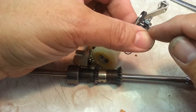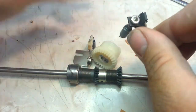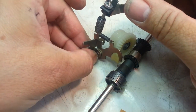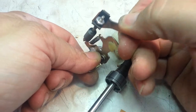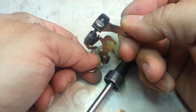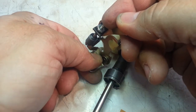Just tighten that up against this spring piece here and that's it — it's locked. Get it a little tighter; that's pretty tight. This piece is in the machine and it engages the back of this, connects right back here. When it's in your machine and running, it pulls that. It's adjustable right here of course. If it's too tight you got to loosen it so it doesn't engage the pawl or the spring clutch — back it off till it disengages by maybe one or two turns.